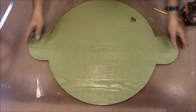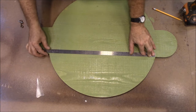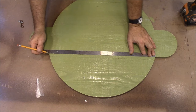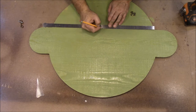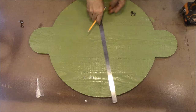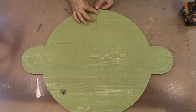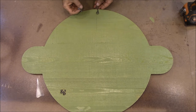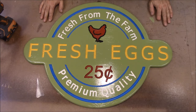I've got to find the center of this, which could be a little tricky. I measure the center — it's 22 and a half inches, so that's 11 and a quarter. I mark that, do the same on the other axis, and connecting those lines gives me the center. I want the hook to sit just proud of the sign and make sure I'm not going through it. That's got our sign finished — I hope you enjoyed this project, thank you for watching.